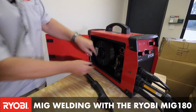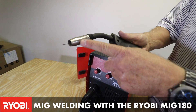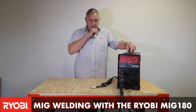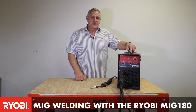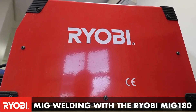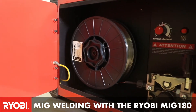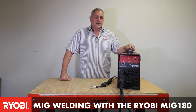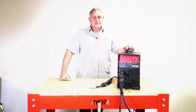What happens is you're pushing solid wire through a torch, finishing the job, and it goes out to paint. When you're arc welding, you would be chipping away at the flux and then grinding it down, and then it would only go through for finishing. It's a nice lightweight machine. You don't have to continue changing electrodes like you do on arc — it's got a wire on a roll that continuously feeds, making it so much easier.